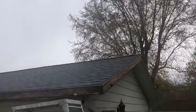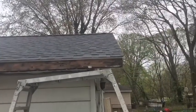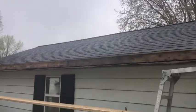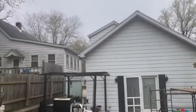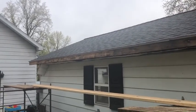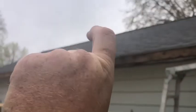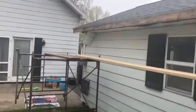There's something I wanted to talk to you about — you might ask why I started from the back and worked forward on that ridge cap. What I did: the wind — this is a west-facing end, basically the end of that garage faces west. What I wanted to do is I didn't want the wind to be coming this way and catching those shingles and possibly tearing them up.